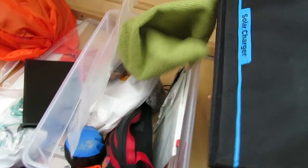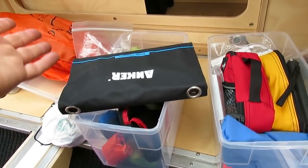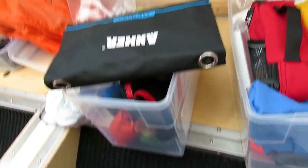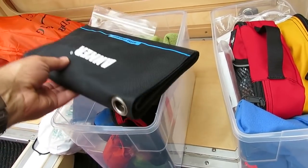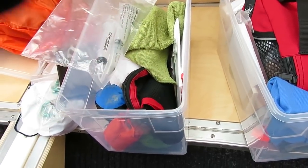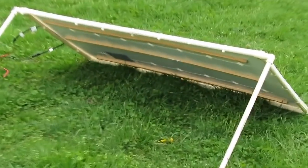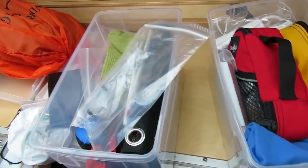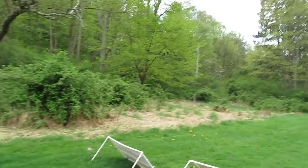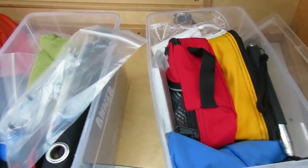There are a couple of solar panels here — these are USB solar panels, they'll charge USB devices, very handy. The trailer has a lot of electricity, so what's the point? If you're not at the trailer and you want to charge something, or if there's a system failure, this will allow you to charge it. I can charge several different things and reduce the charging load on the trailer if I need to. With solar you need to see a shadow — here's my solar panel and there's a slight shadow under it but I'm charging pretty well. If you have a completely dim day you could have a problem. I can barely squeak by with my 200 watts of power.